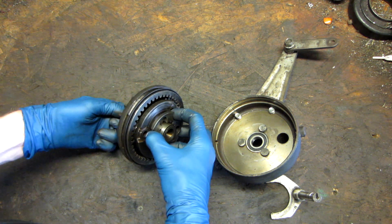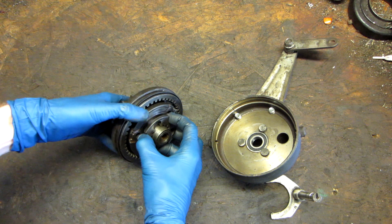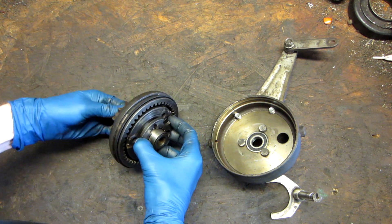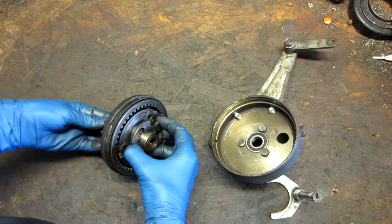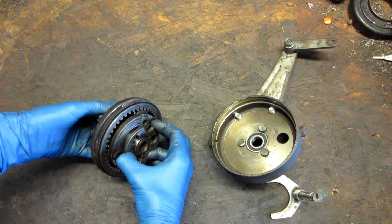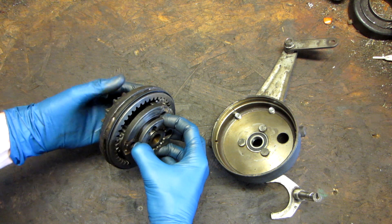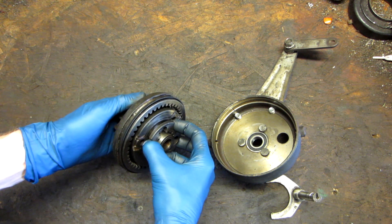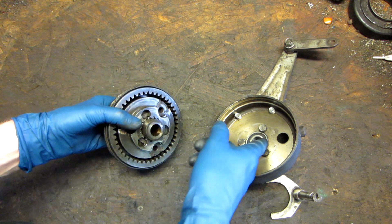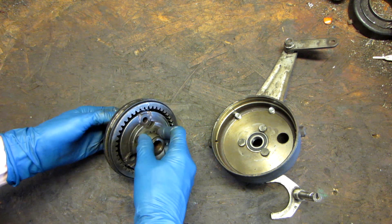This will be a little hard to demonstrate, but when you go ahead and rotate the input forward, because the planetary gear set carrier is locked in place and the teeth are no longer engaging it — but they are engaging the planetary gears and the ring gear — when you spin the input shaft forward, it ends up spinning the ring gear and thereby the output sprocket backwards. Then, when you release the reverse lever, it sets back down, disengages from the housing, and re-engages into the splines on the input shaft, and locks back into forward again.